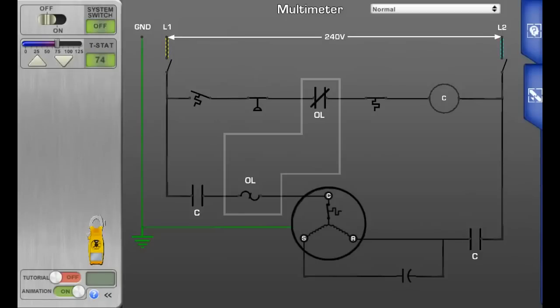In this demonstration we're going to use a multimeter and a schematic, and look at what a normal compressor should look like if you're going to ohm out the windings because you're suspecting it's bad. When doing resistance measurements on any component, you need to disconnect the wires or unplug the plugs to isolate the component you're testing. If you don't, it'll back feed through other components within the system, so make sure you disconnect the component when doing a resistance measurement.